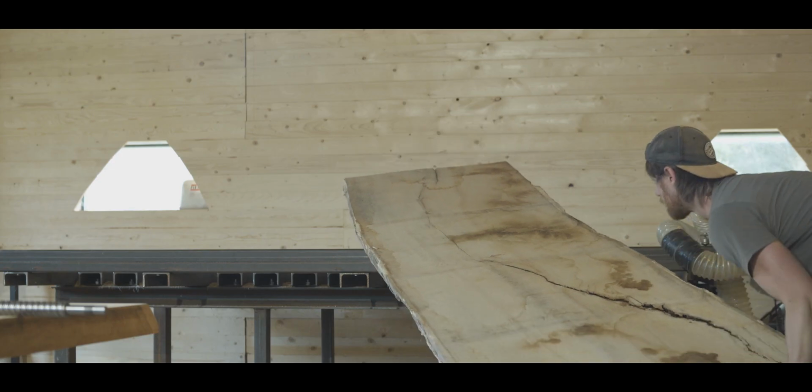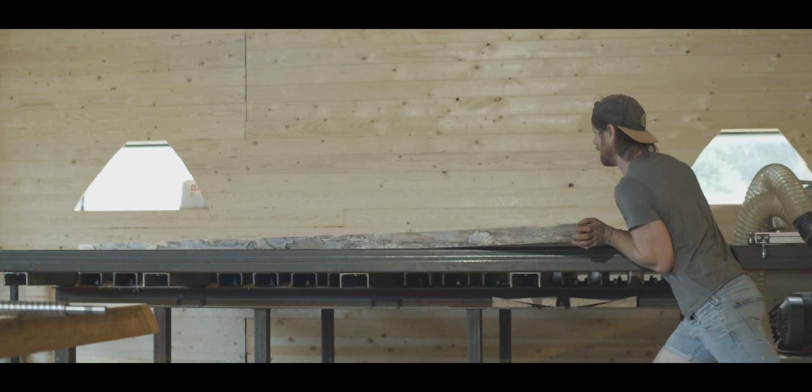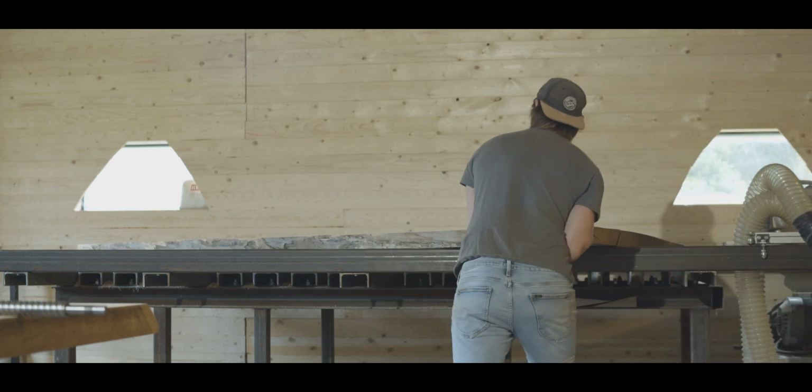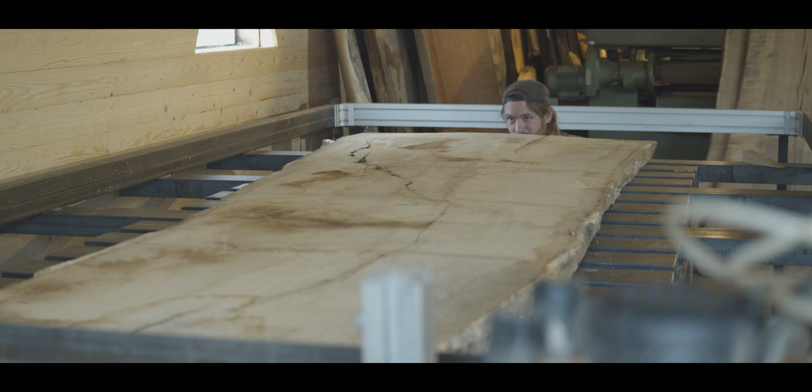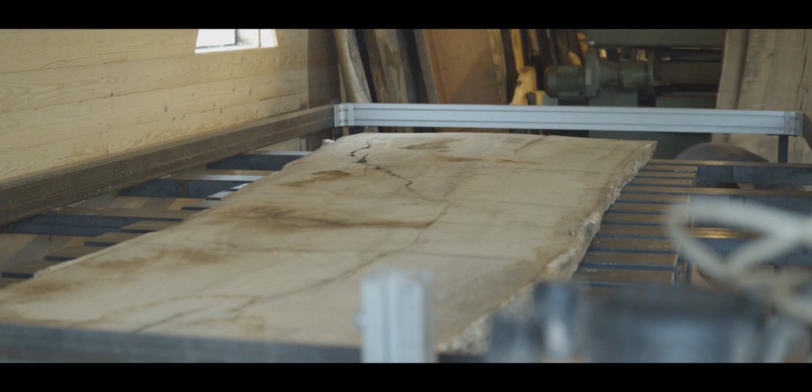So whatever you put on there will then be machined perfectly flat. This is of course very useful when you're working with pieces that are either too heavy or too big to be surfaced on a jointer. I would even go as far as to say that if you have a really good and well-tuned router sled, then you might not even have the need for a traditional jointer and a planer. But of course, that depends on what type of work you're doing.